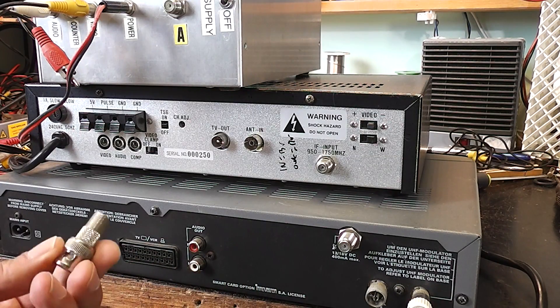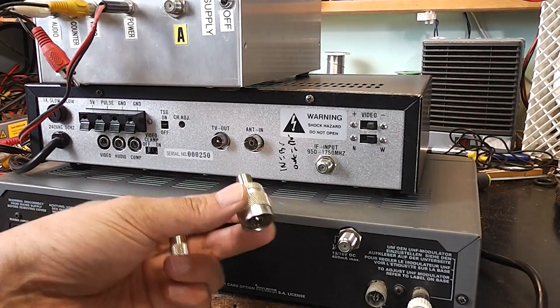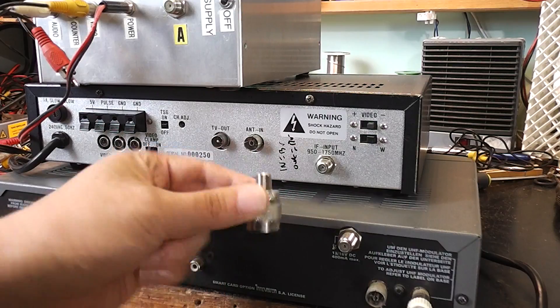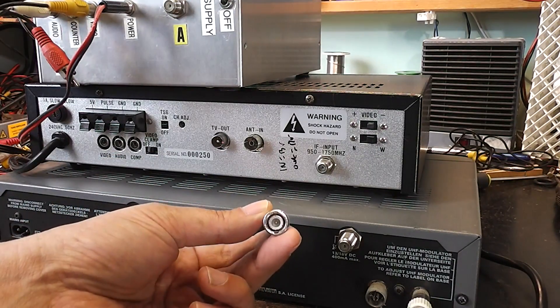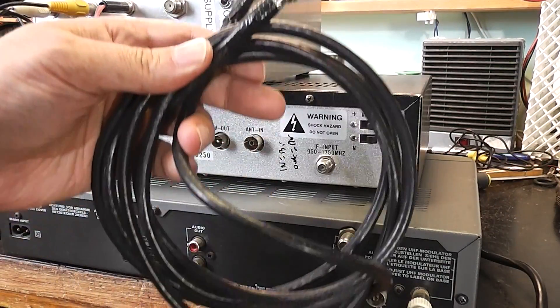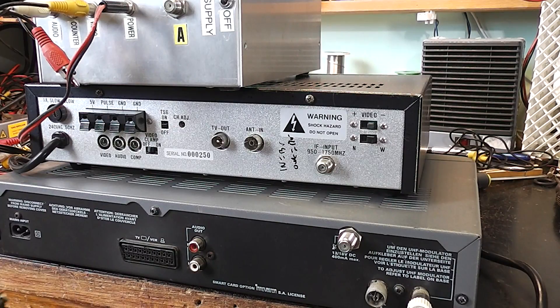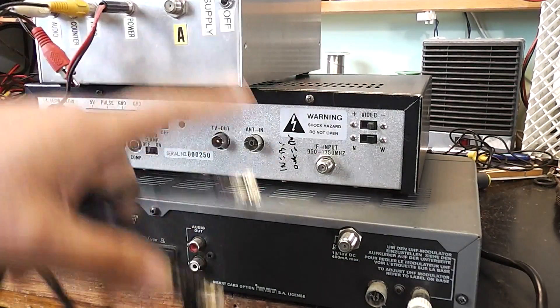I was asked the question: how do you transfer from this to something amateur radio? It is possible to buy adapters. This one is an N plug to an F, and this one is a BNC to an F. And just for completeness, this is just a short F lead that I've made myself. So by using adapters and leads — and try to use the minimum amount of leads — you can connect to this input connector here, here and here.